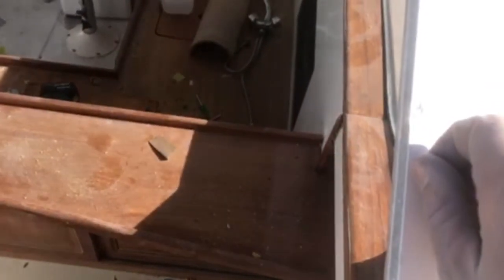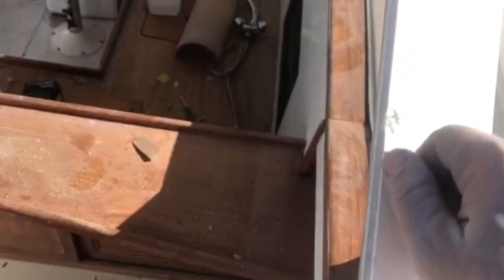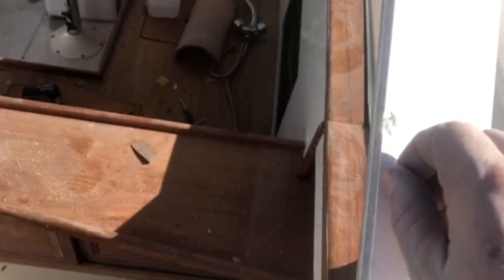Window will go in with the sealant, thread will go in, and on the underside here we will see no bolt protruding through, which will just make it really easy for when we finally get the interior lining through, so there'll be no bolts sticking through to have to cut off or deal with. Only tapping in the fiberglass, you've got to be very careful how tight you do these bolts up, as it will be really easy to strip the thread that's being tapped in the fiberglass and the bolt won't hold.